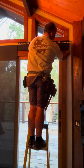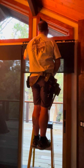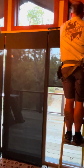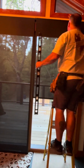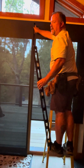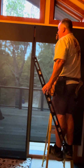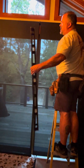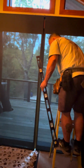This one measured should come right down over the edge here, overlaps the edge here, no obstructions down below. We're looking here, we've got 1.125" is our gap, which is perfect. If this bracket gets set too wide, what'll happen is you'll pull this over and it'll increase this spacing here. So if you're going 1.125", sometimes it's 1.25", but it shouldn't be 1.5" or something like that. Then you got loose brackets, your brackets are set up too wide, the shade could potentially fall out or skip on the upper limit.